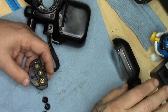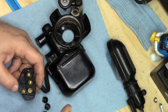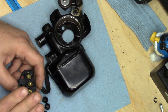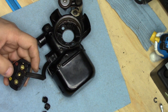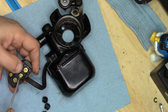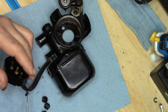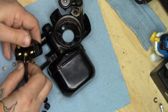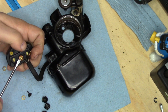We're not going to worry about that light initially — what I'm going to worry about is the motor. If I do wind up reusing that light, I will do a separate video on it. I'm getting this off the power block and I can see now that the insulation is a lot worse than I'd even feared — it's literally peeling off in my hands. We're going to use crimp-on ring terminals in the rewiring process of this motor.